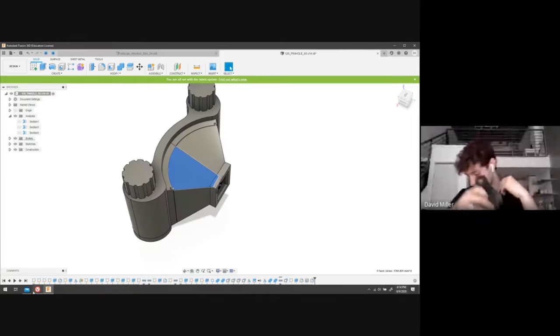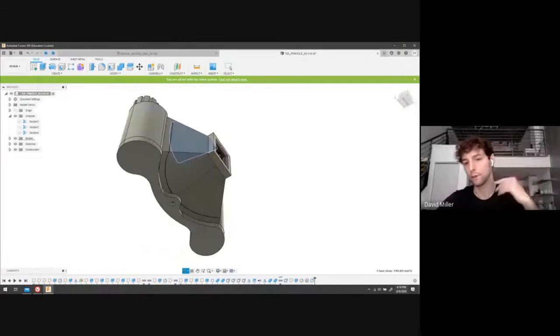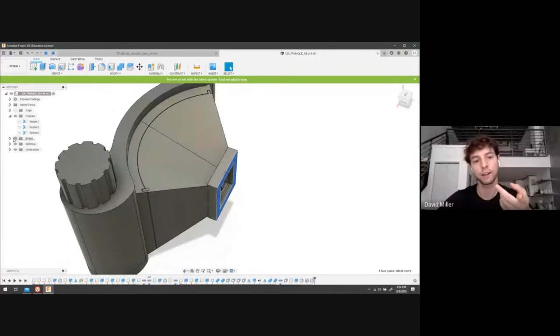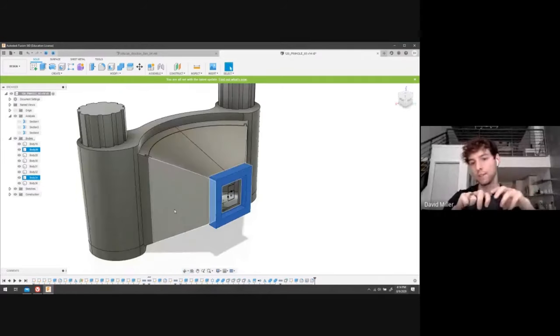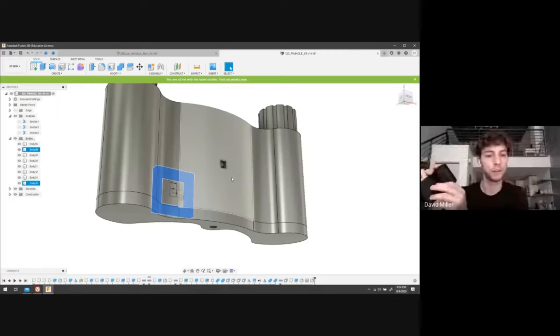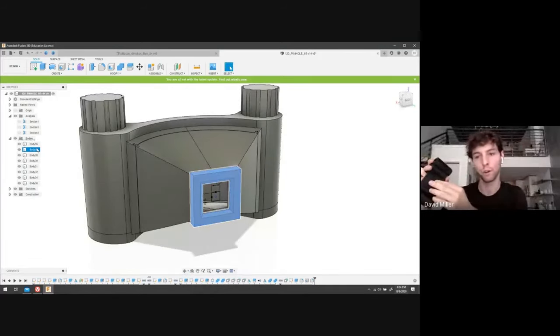And then the other piece of information on this is we just used a piece of tape over the front as a shutter, and there's a little slot in the back where you can see the film counter, and we had another piece of tape over that. You wind the two top knobs in tandem, and that advances your film, and you can see in that hole on the back when you're at the next frame. So it's every two frames, starting at 2, 4.